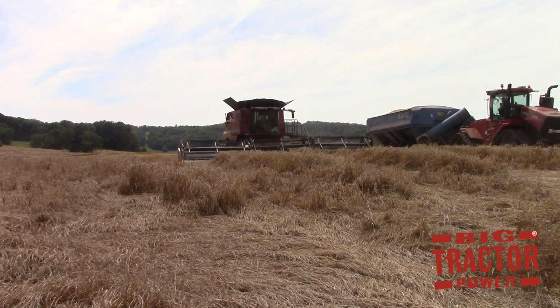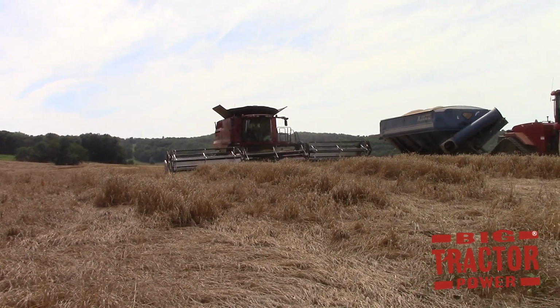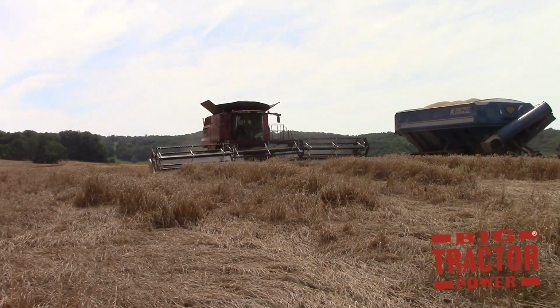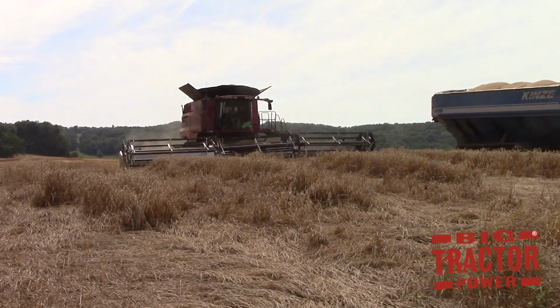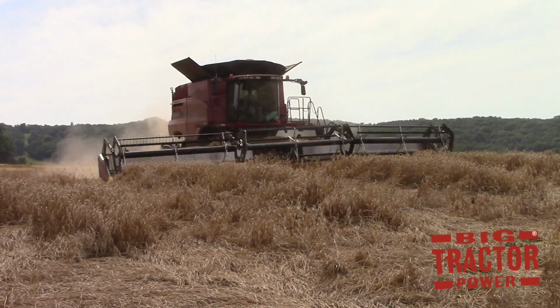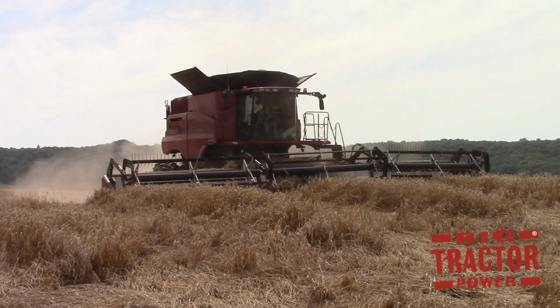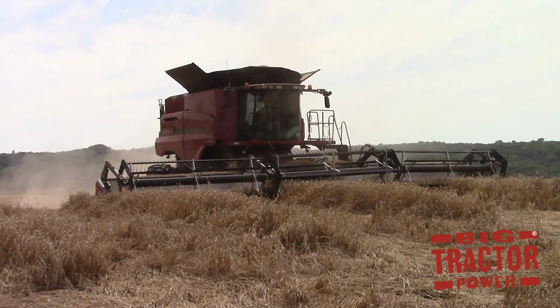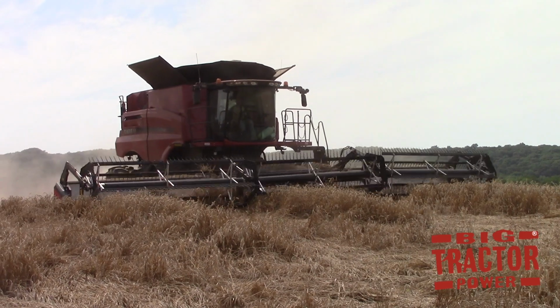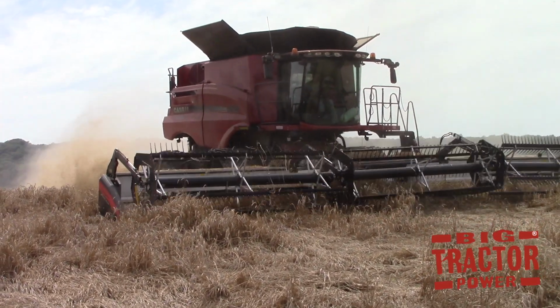And these center drive knives really cut the ground like a razor, and as we see this Truflex come up right next to us, we'll see what a good job it does in slicing through this flattened wheat. Again, that 4-inch dividing point on the outside is slicing a straight line right through the standing and flat wheat, and it's not knocking anything over on the outside of the pass or pulling anything in or knocking grain off.